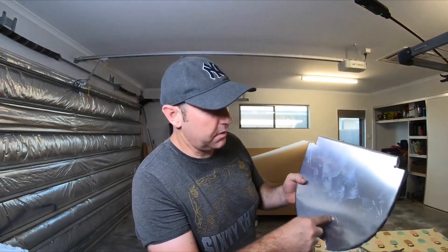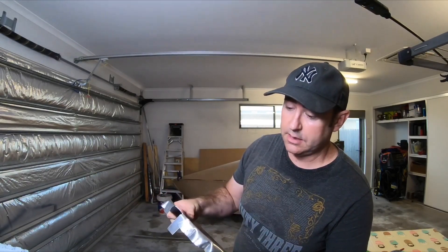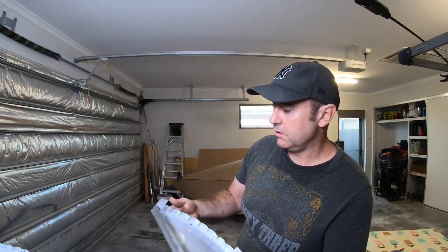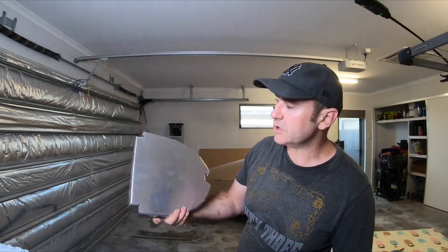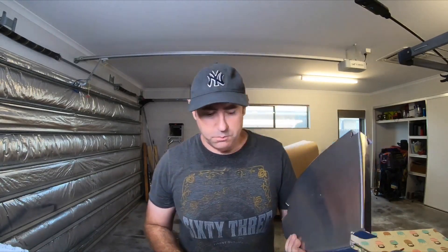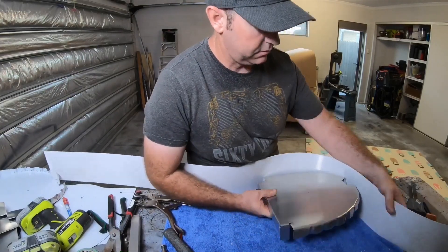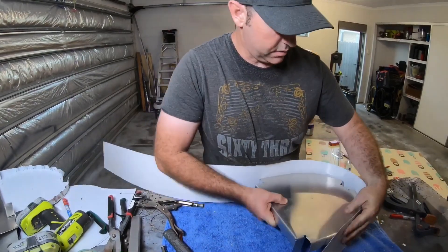The centre hole here is going to be a really large lightning hole. It's one-mil sheet — actually really tough sheet, probably the hardest of the sheets to form at this thickness. Usually wing ribs are 25 thou, like 0.5mm, so these are definitely a lot more work, but I need it for the strength.